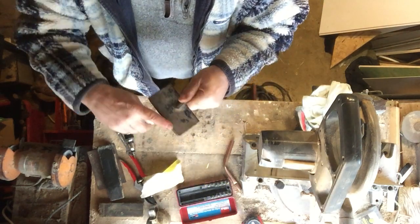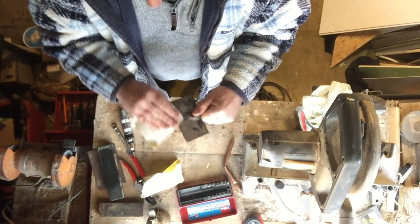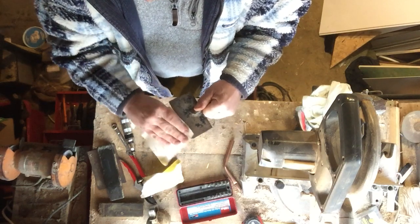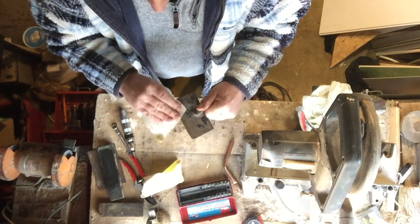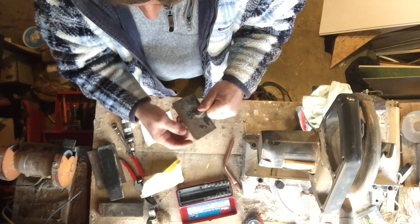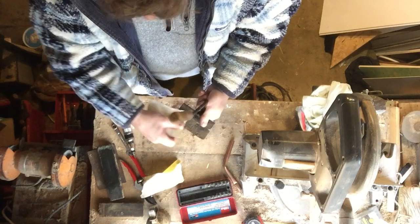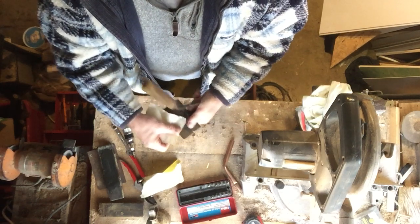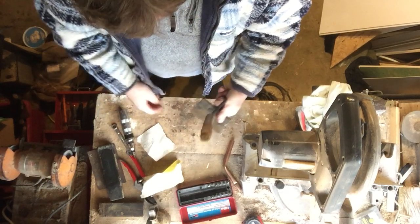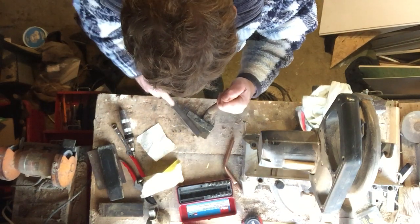You've got the blade on it. I like to file this part of the blade. You can quite easily see when you're looking at your hoe which end needs to be sharp — on the front or back. They'll be partially done already, but they're not that sharp. It doesn't need to be razor sharp. All I'm doing at the minute is taking the rust and some of the mud off. And also when you do something like this, you're looking for high points as well — if you've got any high points on them, you may need to take a file to it. Just wipe them off.